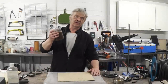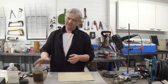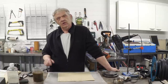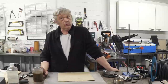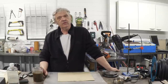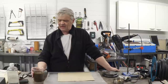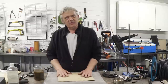What I've got here is a bioplastic resin, actually based on seaweed. If you want to know how I made that, just check out the video on seaweed bioplastics basics. There are a couple of changes: in the ratio here I used 25 grams of seaweed and 50 grams of cornstarch to one litre of water. The rest is in the pan. I also soaked the seaweed for 24 hours before making it, then made it the same way as the earlier video — and that gave me quite a liquid resin, because I want a liquid resin for composites.